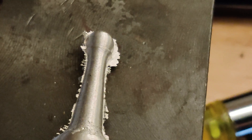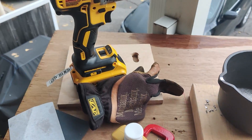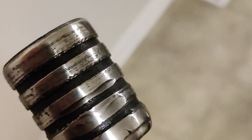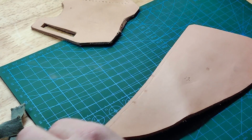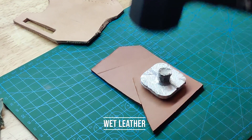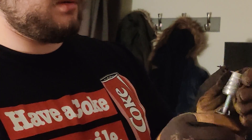I ended up polishing both the pawn and the lightsaber piece. For the pawn, I had made a sprue so I could chuck it into my drill, work up through grits of sandpaper, and then finish with brass polish — both pieces came out with essentially a mirror finish. I put some paint in the low spots of the lightsaber just to create contrast. The chess piece did lose a bit of its shine after clear coat. The leather stamp worked well mechanically, making a good solid imprint, though the top wasn't perfectly level. I was also able to drill and tap a hole in the lightsaber piece so it could thread onto the rod.